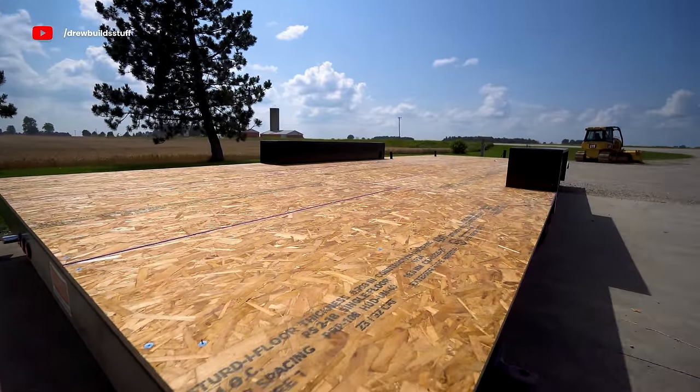Now I'm going to cut a template truss for the steeper part of the roof. So I have this whole thing designed on the computer, so I just spit out these dimensions so I don't have to actually measure it on site. So first I set my miter saw to the angle it said, which is 33.5 degrees, and then I cut off one of the ends of this fresh 8-foot 2x6. Then I measured from the cut point as long as it said this rafter is supposed to be, and I cut a second angle at this point.